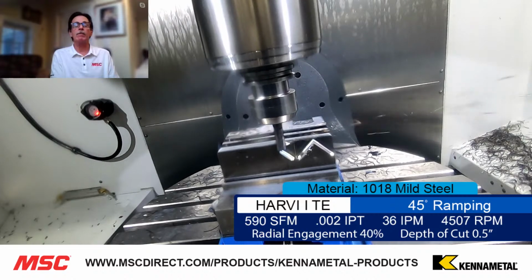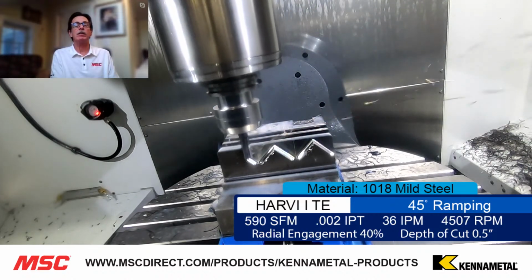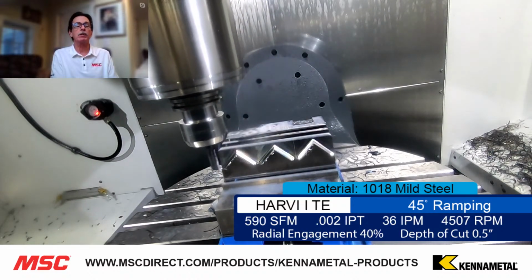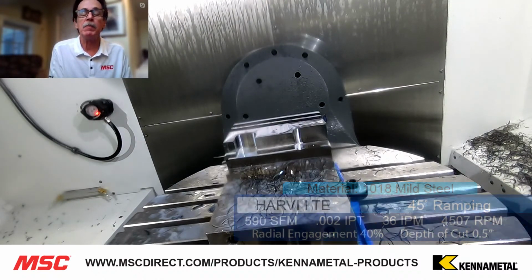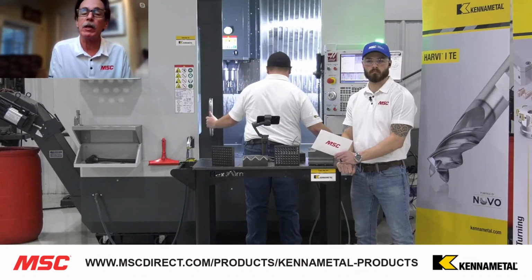This is a 45-degree ramp. And those of you in machining, you probably have not seen that happen. This will do this in a blind pocket, by the way, in a full slot. We did this for the purpose of showing you that capability. But keep in mind now, when you see that, because this thing can do that or plunge like a drill,